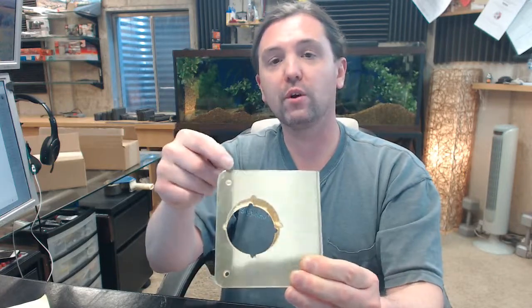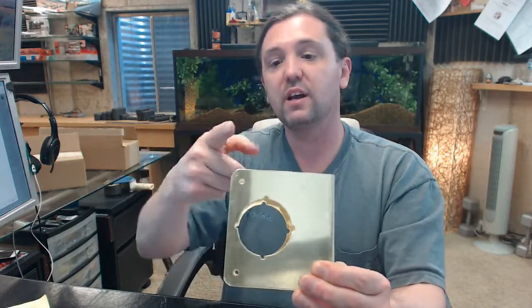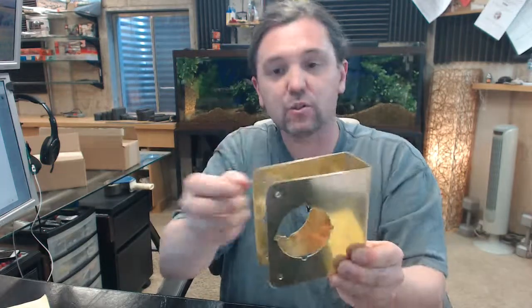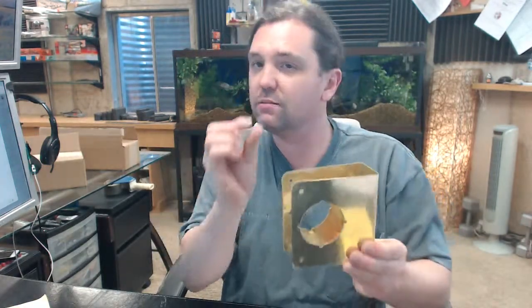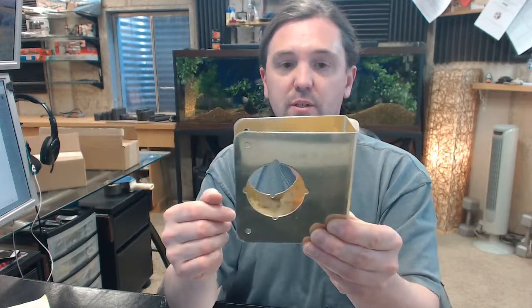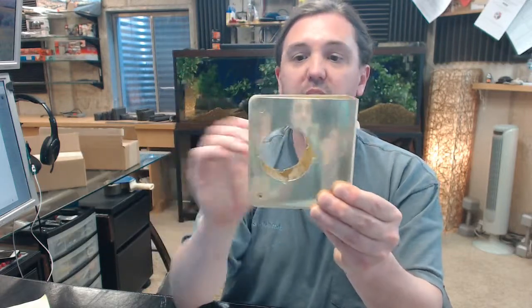And when I go about installing these, I will certainly pre-drill my hole, but I will pre-drill the hole ever so slightly so that I'm setting a small amount of angle on here, so that when I run the screw in, it just imperceptibly pulls that a little bit tighter against the edge of the door. I want that as tight as possible. And once I've got those screws attached, I would then go ahead and complete the installation.